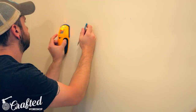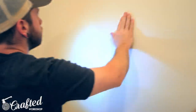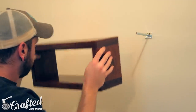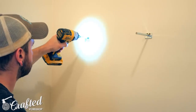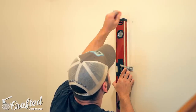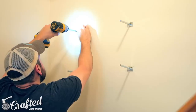Finally it was time to hang the shelves. I used a stud finder to mark the locations of my studs, then mounted one of the blind shelf supports to the stud using two-and-a-half-inch screws. To mark the location of the other shelf support, I put the shelf post into the hole in the back of the shelf with the set screw installed, leveled the shelf, and put pressure on it to mark the exact location on the wall. I installed the other shelf support, did a test fit, and it looked great. With the first shelf done, I marked the location for the top shelf, making sure my marks were plumbed to the first shelf using a level. I spaced the upper shelf 10 inches above the lower shelf so that they were arranged in a square.